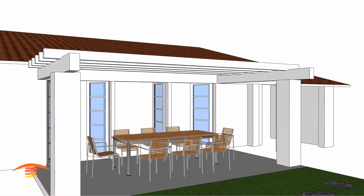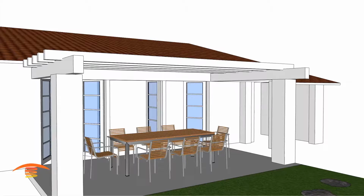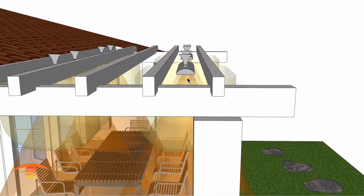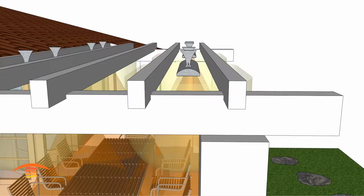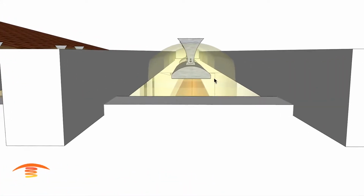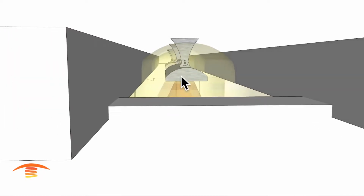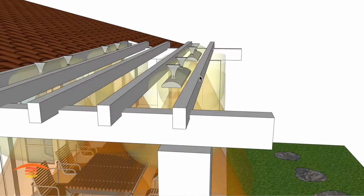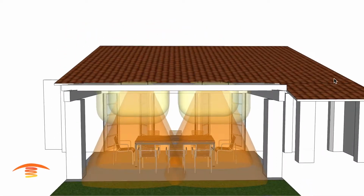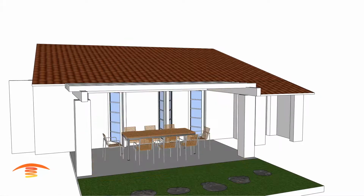And then I thought, well, I like to get a little bit hotter unit, so let's use the C series. But the issue with the C series is, again, clearance above. I can't meet the clearance above. Now there's 6 inches from this side here, and this heater is a little bit wider, so that doesn't meet. So that's no good either, but again, I'm trying to get a nice warm location up here, so let's turn that off. And that off.